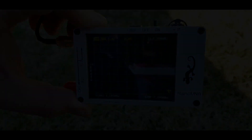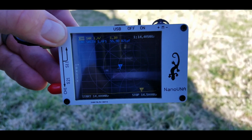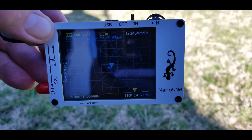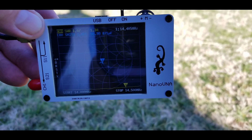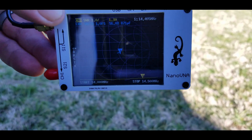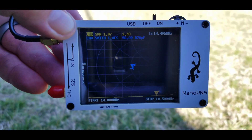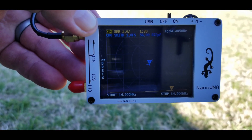Now we're set to 20 meters. What's the VNA showing us now? It's showing incredibly flat. We were kind of surprised — we have double-checked this with the MFJ and it's pretty similar numbers. We're between about 1.23 and going up to around 1.32 across the usual part of the 20-meter band here in the U.S. No tuner required for this band either. It's doing great so far on all the bands we've checked.